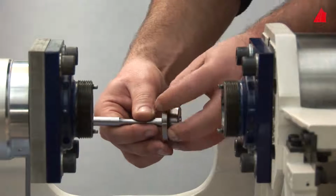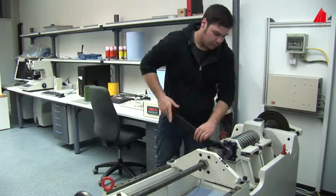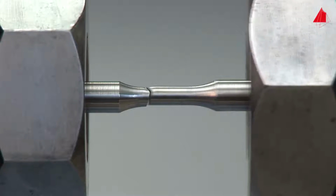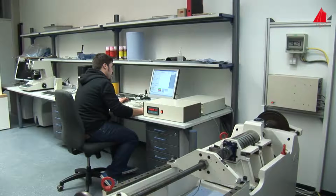For this purpose, the material tester picks the next specimen from his supply and installs it into the fatigue testing machine. He chooses a higher alternating load for the second specimen, a tensile force of 7.5 kilonewtons and a compressive force of 7.5 kilonewtons. Under the increased load, the specimen is only able to withstand 43,600 cycles to failure. The third specimen is only tested with a cyclic load of 6.5 kilonewtons. Under this reduced load, it does not break even after 3 million load cycles.